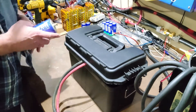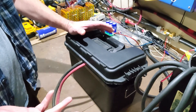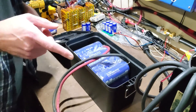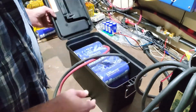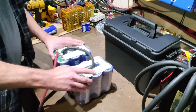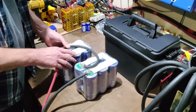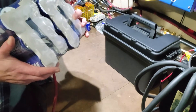People ask a lot of questions about how I've got these connected up to my system. Here's my bank of capacitors for my larger solar system. This is connected live so I'll have to be careful — I put it inside one of these little ammo containers for safe keeping, but I can pull it out and show you. I've got this connected to my battery bank with 2-gauge welding cable. These packs are already pre-assembled with balance boards on them.